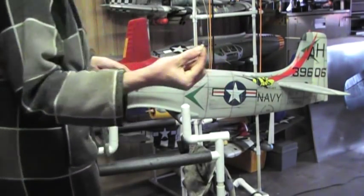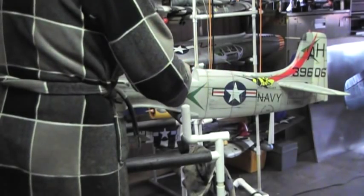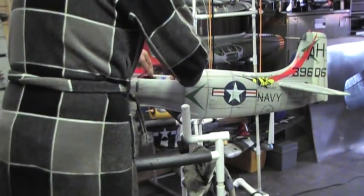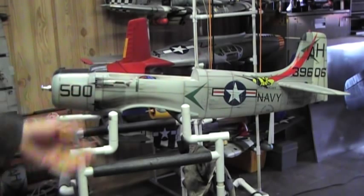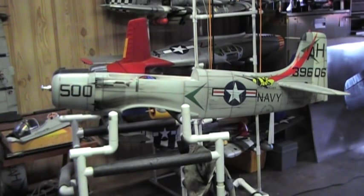Simply change the SD card after you've powered it down, then plug it right back in. I have a JST tap off of my battery, so the minute I plug in my battery — this 4-cell — it automatically powers up the Shockwave. It has two circuits: a lower circuitry and higher circuitry. In order to get the sound, you have to have power to the higher circuitry, and I'm tapping off the battery right now. This one's 4S. If I plugged this into a 6S, it would be much louder, but this happens to be a 4S airplane. Here's the startup of my modified A1 sound.